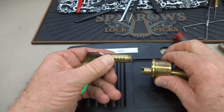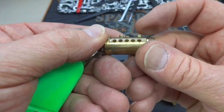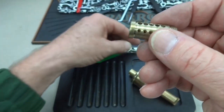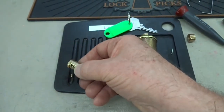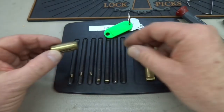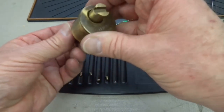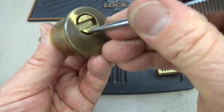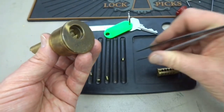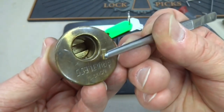We've got some construction holes — no biggie, didn't play a part. Looking at the pins: a couple of them are rounded — number five and number two look slightly rounded on top, and I can see a serration on number five. One serration, standard; one serration, standard; and the last one all serrated — looks homemade with nice sharp serrations. Turning those around — looks like some very light serrations; commercial serrated.